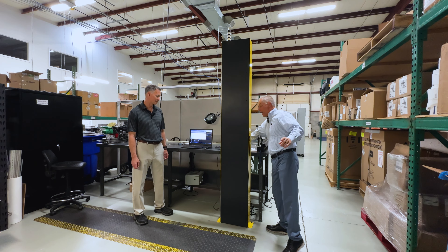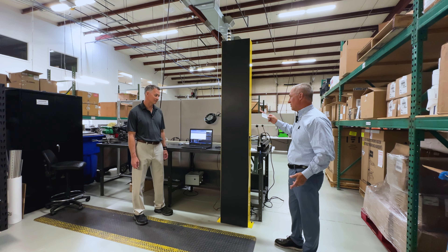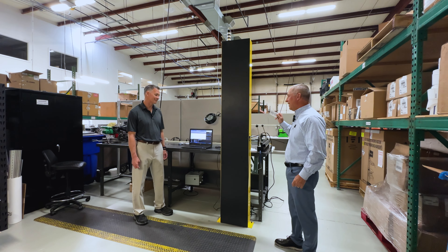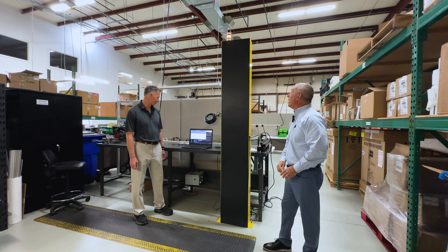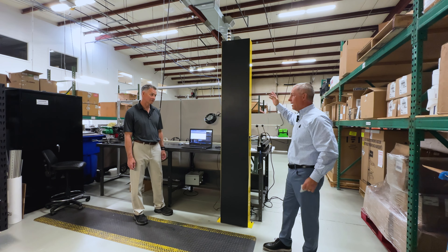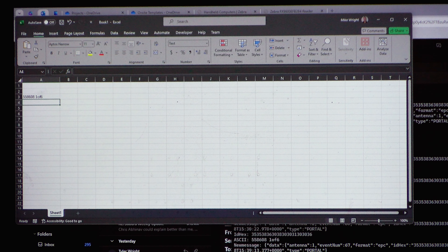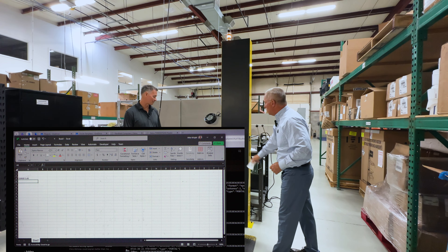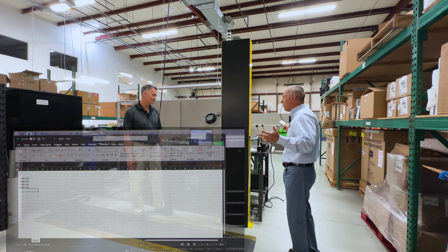I've got one of the customer's tags here, and I'm going to show it. It's 558-608-106 — that's what it says, and that's what's encoded in the RFID tag, probably with some other stuff, but we only want it to show what's there. So we're going to do that — the green light went off and it beeped, just like a barcode scanner. And in the spreadsheet it actually showed up. I'm going to do it three or four times here, and it just pumps the data in just like a barcode scanner.